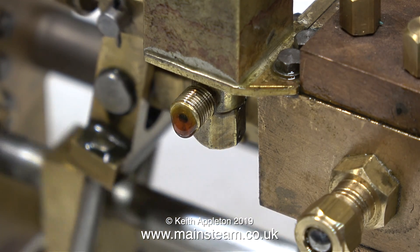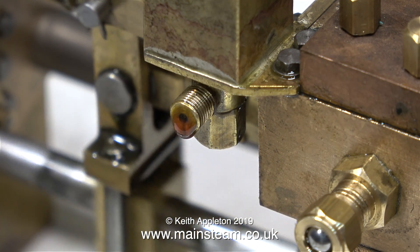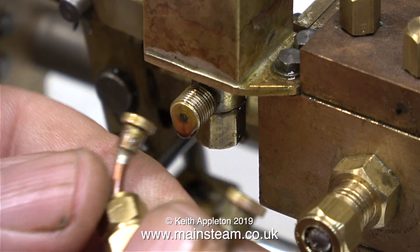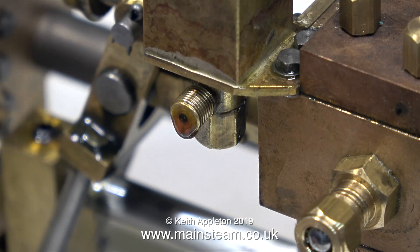This type of oil pump depresses a piston inside, but it must depress it just the right amount. Too much — no oil. Too little — no oil. The adjustment is quite precise. I think it's time to put the pipe back in place and give the engine a good run.